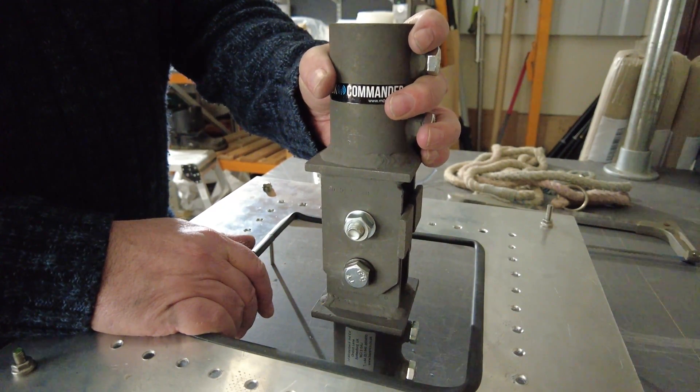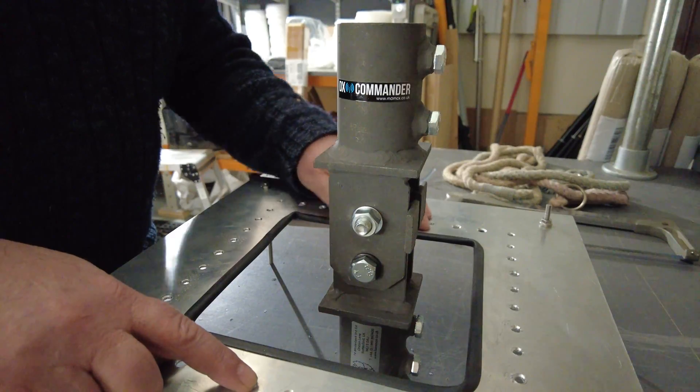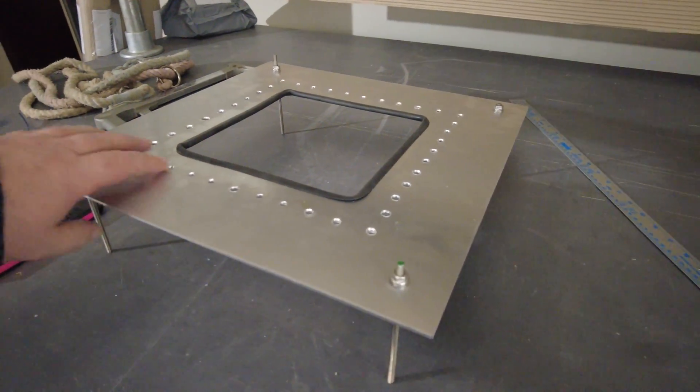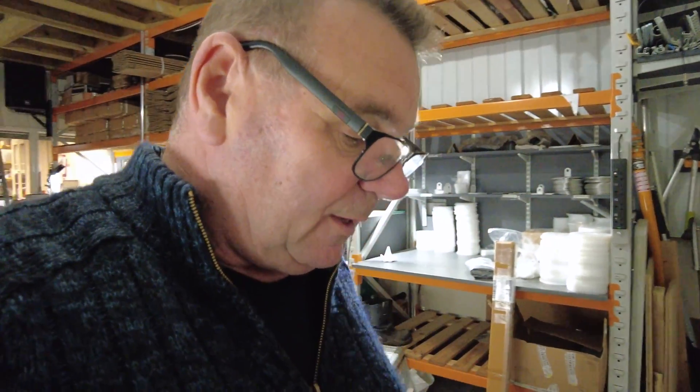What I need to do now is dig a hole in the ground. We'll cut a scaffolding pole down, join it with this to make it extra long to start with so we can use a level and make sure everything's straight. Then we'll take it all apart and cut the scaffolding pole square, bury it into the ground up to that point. I've just been on the phone to my supplier to get some 20 millimetre bolts — just under an inch — and nuts in 6 mil, because all the four connectors will be connecting here, and the braid will connect from the antenna to there as well. The next video is part two — I'll start that one tomorrow, we'll dig it out, install it, and get it all working.